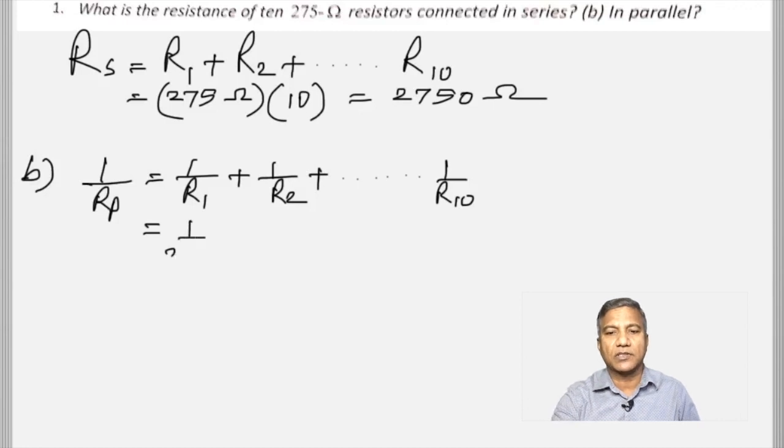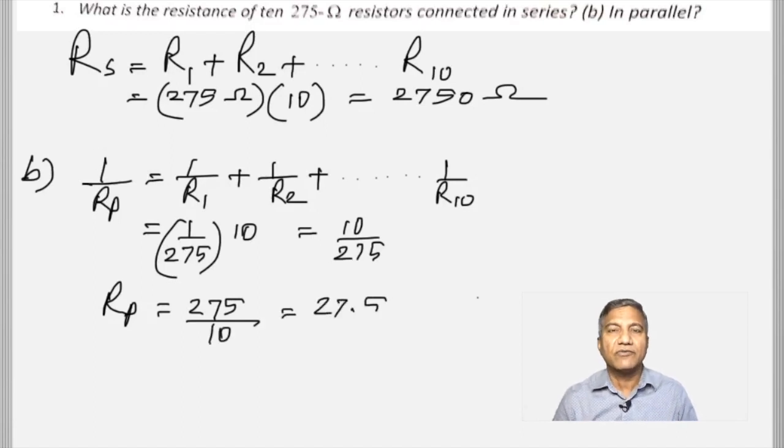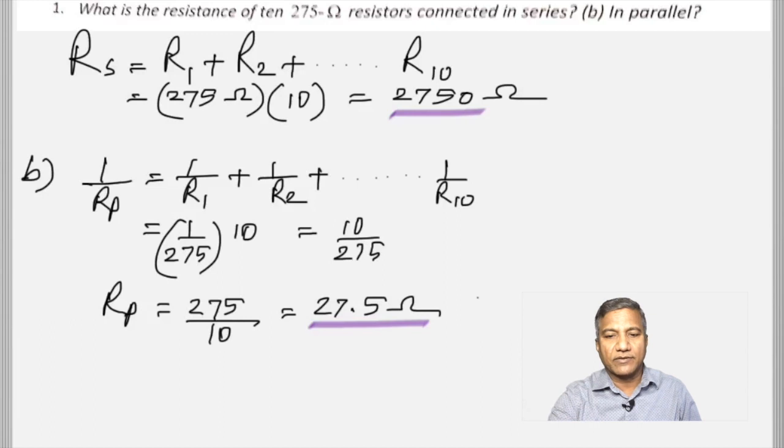But when it comes to parallel, the reciprocal of the total resistance is equal to the sum of the reciprocals, as you can see here. So when we do that math, we get 1 over 275. We have to do that 10 times, which will give 10 over 275. But when you reverse it on the left side, you get R parallel, which makes it 275 over 10,